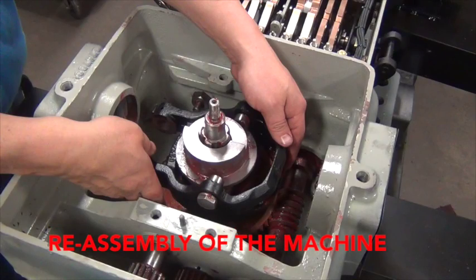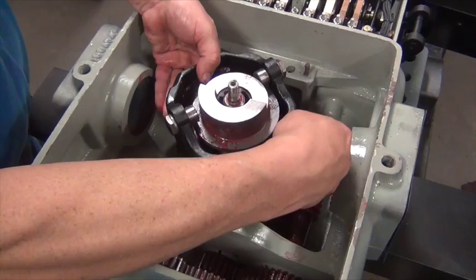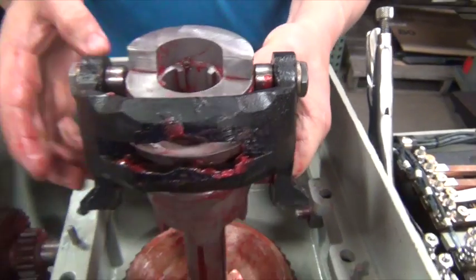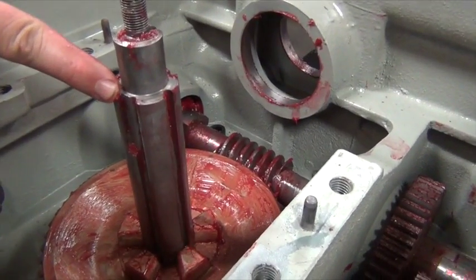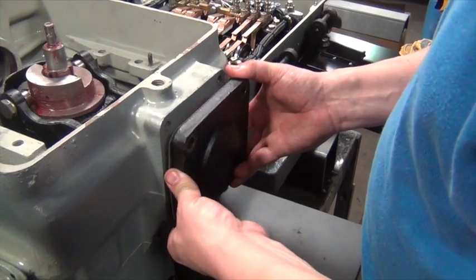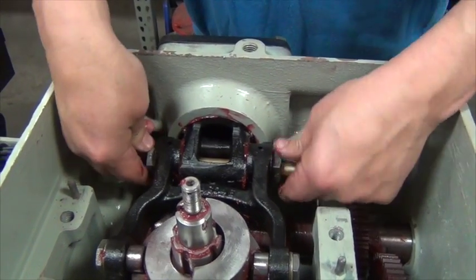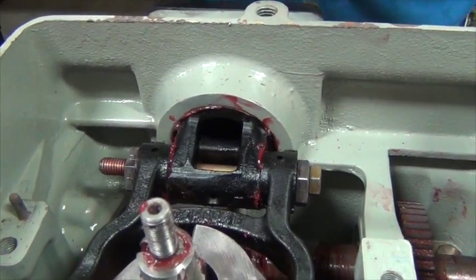Now we will begin the process of reassembly and timing the machine. Lift the yoke and shifter to clear the walls of the gearbox and rotate it around to the opposite side. If you remove the shifter from the machine, note that it can only be properly installed one way — there is a locating pin on the inside of the shifter that must be engaged with the wide keyway on the side of the crank. Reinstall the yoke hinge bearing on the opposite side of the machine and secure it with four screws and lock washers. Reinstall the yoke hinge bolt and eccentrics in the same manner that they were removed. Orient the eccentrics so that the end for neutral is facing upward on each side. Do not tighten the screw at this time.